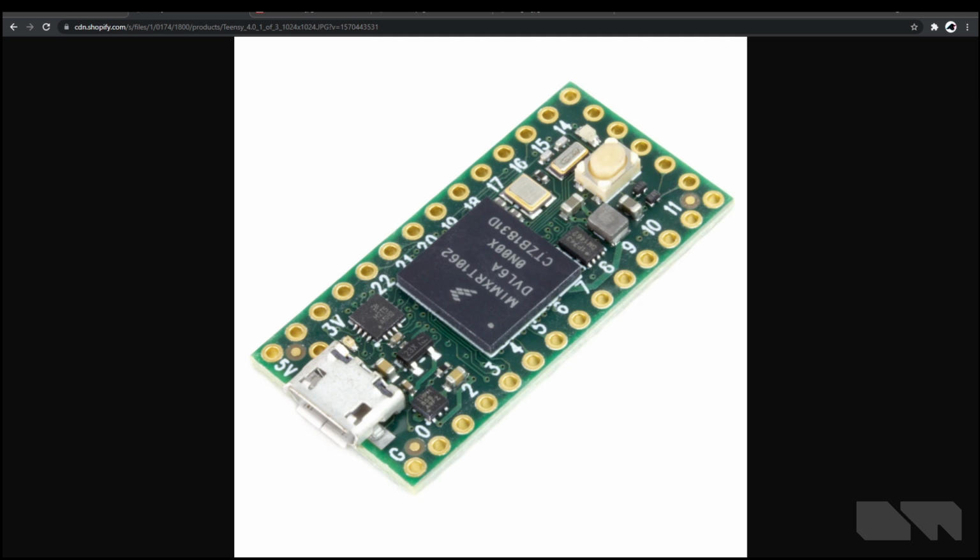The funny bit is on the beta M8s, it was a twofold problem. One was whenever there was a failed soldering job, because basically it's a blind soldering job. There are pads, like you see in the picture I'm sharing right now, and there are pads actually underneath the teensy as well that you don't see there. So if anything went wrong on those boards, I had to basically desolder the teensy off the board without damaging the teensy. So it was a big headache for any board that didn't work.